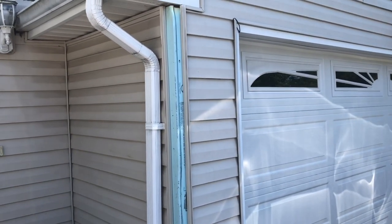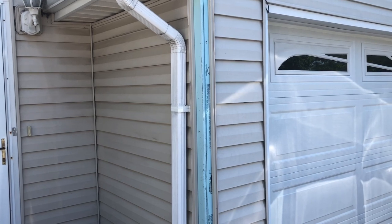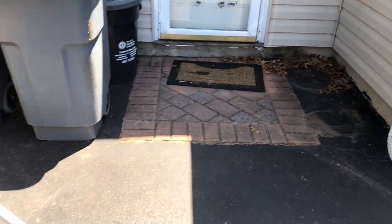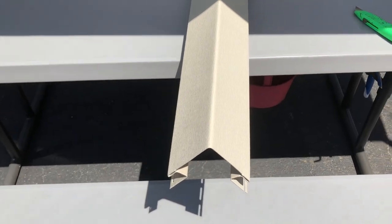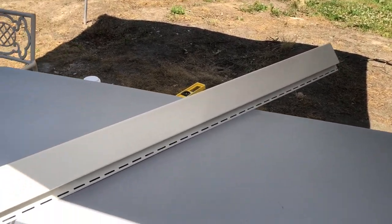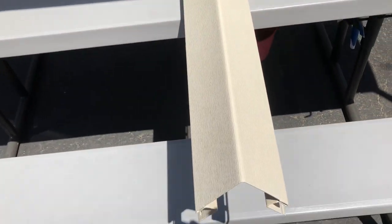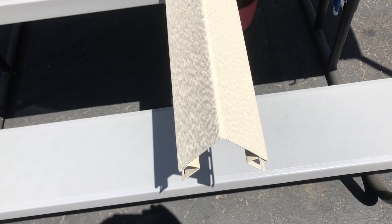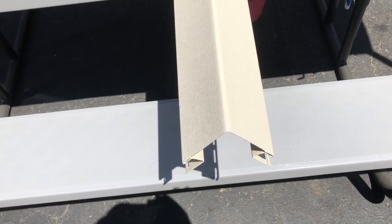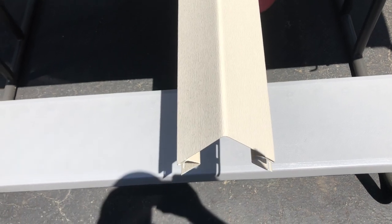Okay guys, I'm back. Where I left off was I cut the existing corner piece — the outside corner of the vinyl siding — off. I showed you where to make the final cuts to accommodate the new piece of outside corner. There it is — it was 10 feet long, now it's 78 inches long, and we're ready to make the final modifications to this outside corner to accommodate going on the existing outside corner that's being repaired.